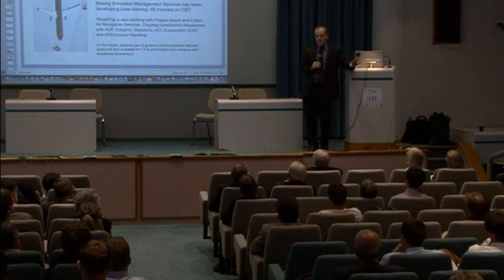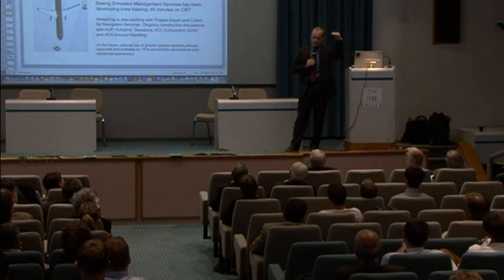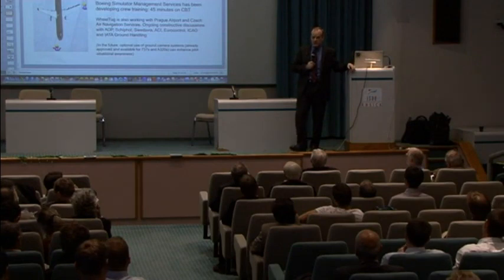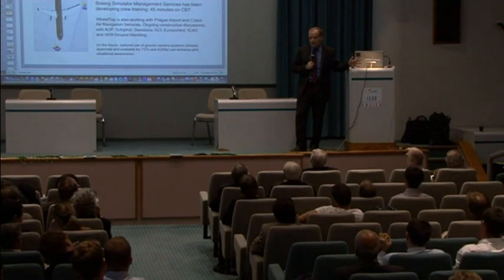So the engine time is, and I gave those numbers, about $1.50 for maintenance and $1.54 per minute for fuel consumption. And so depending on the operation, WheelTug or any other solution is going to engineer for a different case. So we like gate operations and stop and go. Because once you're going 20 or 30 miles an hour, the runway is only a few minutes away anyway. In which case, why are you running your e-taxi? You have to start your engines.